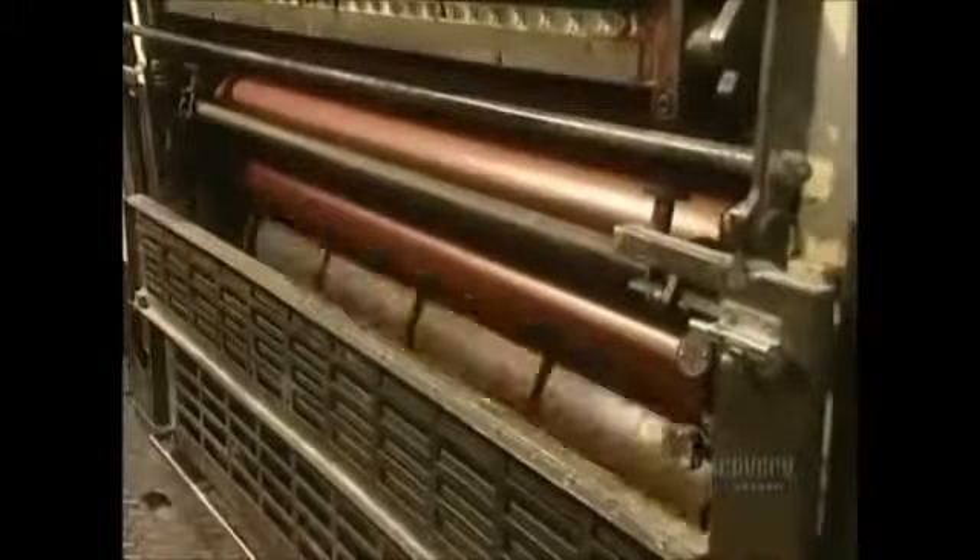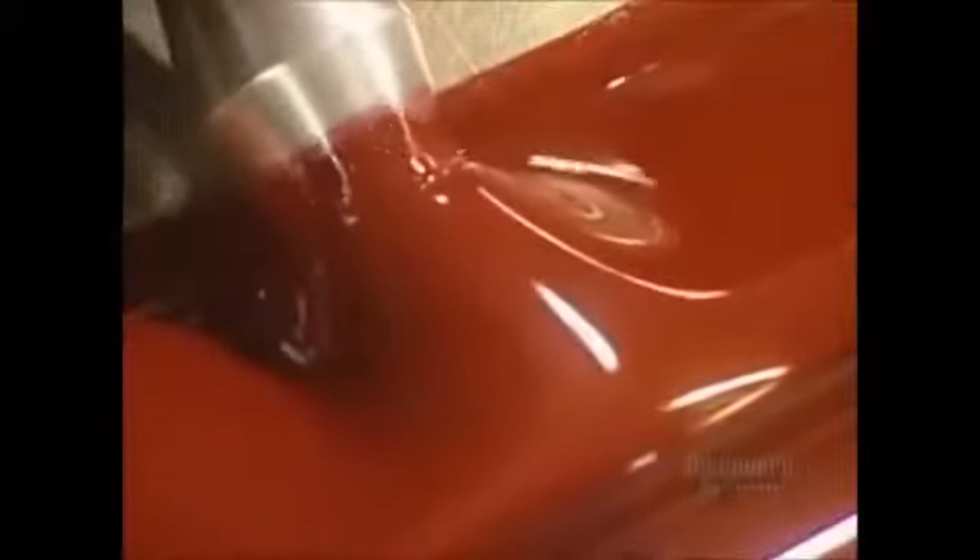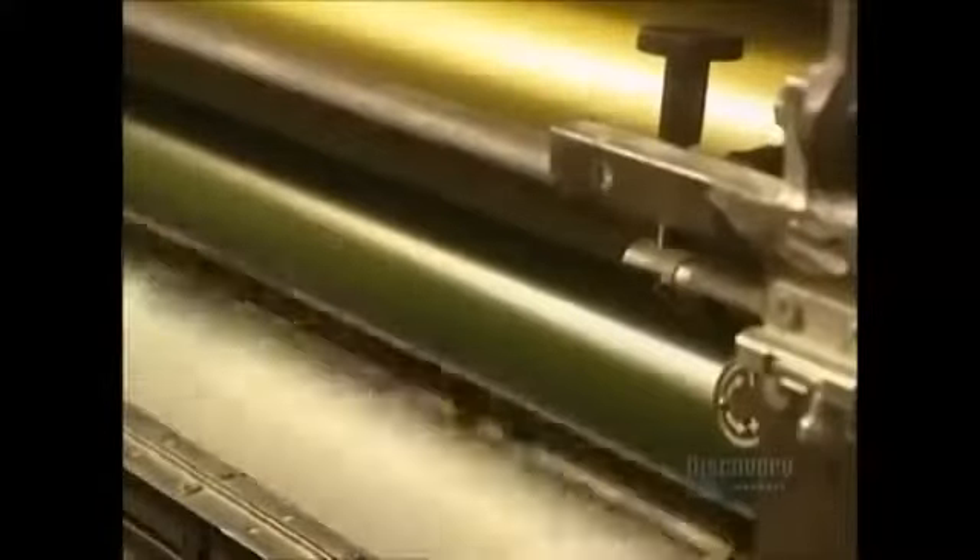This plate will contact the inking rollers of the ink reservoir. To prevent it from drying, ink viscosity is maintained with this oscillator. The press starts up and reaches a production rate of 8,000 impressions in 60 minutes. The press comprises individual color printing units, and the paper sheet passes from one unit to another, receiving a new color at each step.